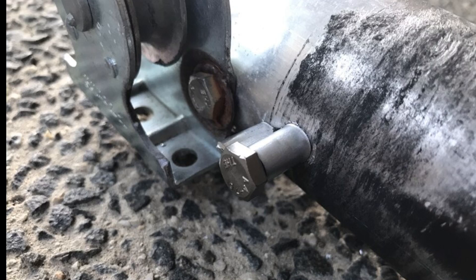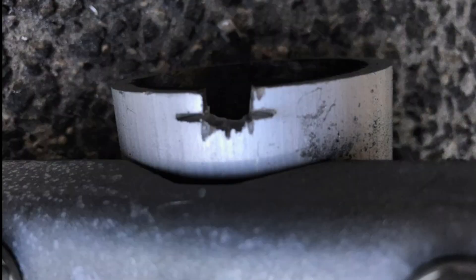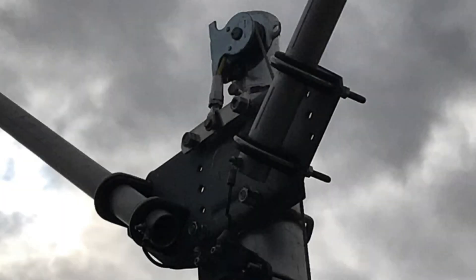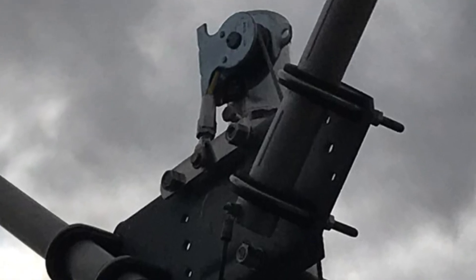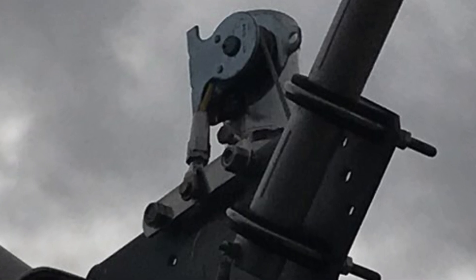I touched on the reason why I wanted a bolt and notch cut at the top of the pole near the pulley to stop the antenna rotating while it was at the top, and I did that. The notch is shown here. I cut this out of the sleeve that gets dragged up and down the pole using a Dremel cutting blade, and you might be able to see it at the top of the mast here. There's a little bolt under the pulley and then the sleeve locks into it — this is to prevent fatigue breaking the cable between the pulley and the sleeve.